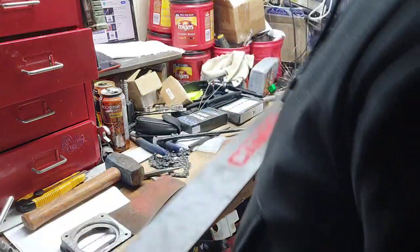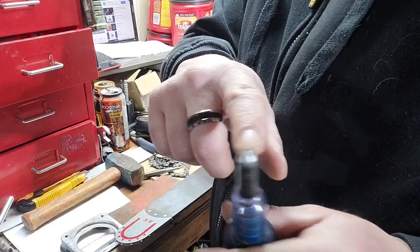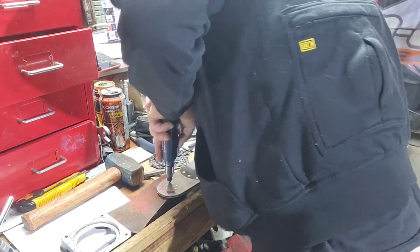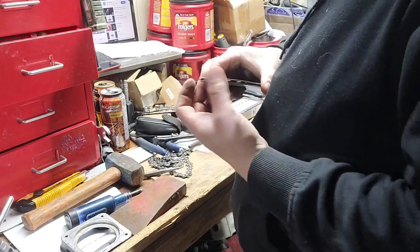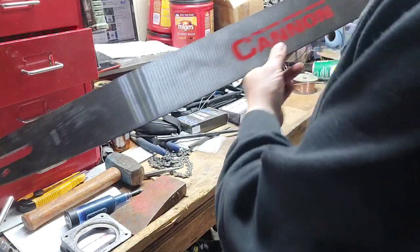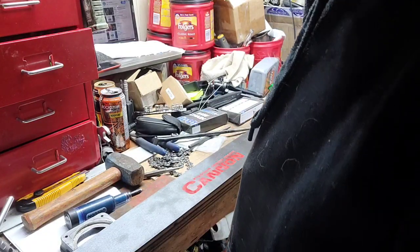Also, this falls into the bar maintenance side — some of these old tips have an actual grease hole in there, and that's what one of these little greasers is for. On some saws — like the Husky 55 or 266, maybe both — you can actually put this in at the end of your crankshaft and it will grease your needle bearing. I don't think there's any grease in this one, but I'm going to give her a couple of pumps on each side. I can see the original grease still in there. So there it is — a 3/8 sprocket, medium mount. Just need to get it chained up and get a saw to run it. Anyways, that's it for this one — have a good day.